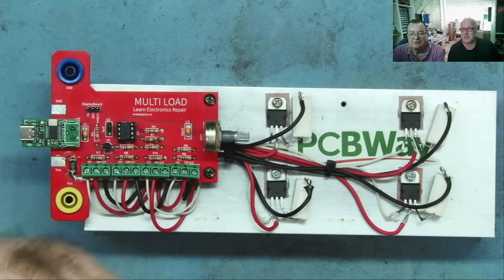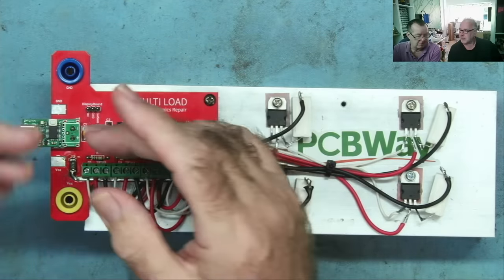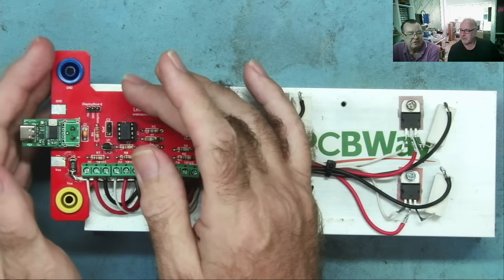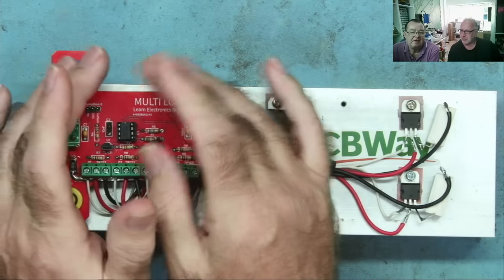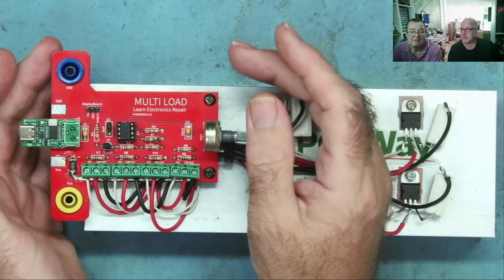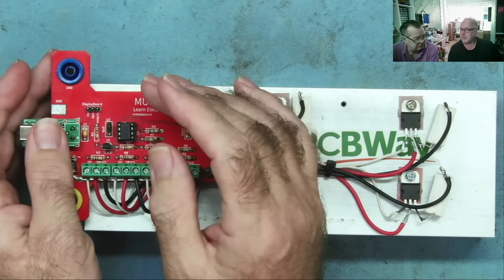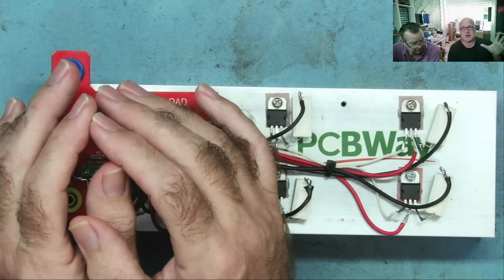The last consideration was how much power does the daughter board draw? In the worst case scenario, we have 30 volts coming in, we have 3.3 volts going to the processor. So that linear LDO regulator is dropping 26.7 volts. So it gets toasty. We figured that around 10 milliamps was a nice maximum current to draw on the daughter board. That gave us about 270 milliwatts on the full voltage input. And the LDO we're using could handle 600 milliwatts dissipation. So this is directly for design considerations.